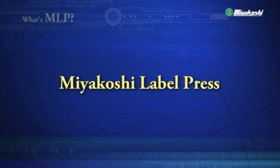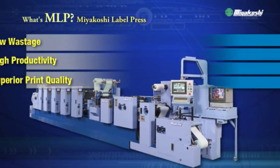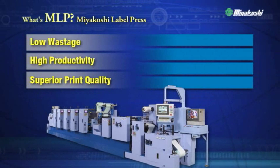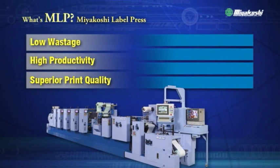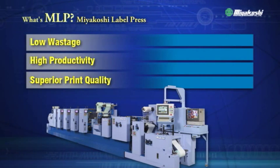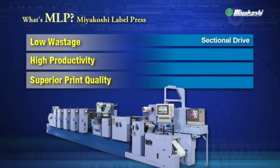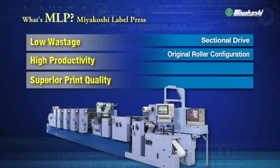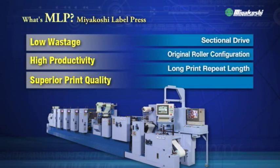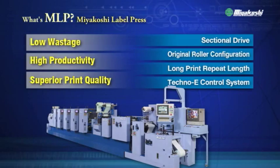MLP, Miyakoshi Label Press, is a high-performance web offset press which gives customers higher profitability, realizing low wastage, high productivity, and stable print quality. This is offered by means of business form-originated shaftless technology, Miyakoshi original roller configuration, long repeat length of 355.6 millimeters, and a highly refined NC control system called Techno-E.